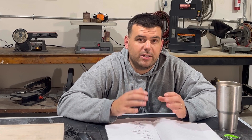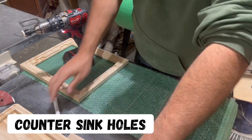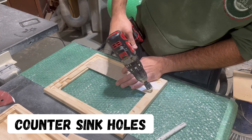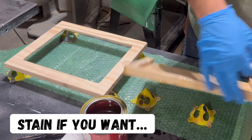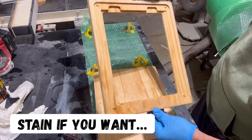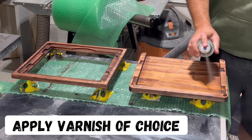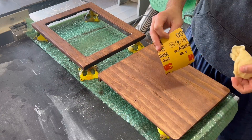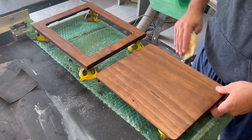I decided I wanted to stain this project, but before that I want to countersink some screw holes into some of the components. I did a dry assembly with the storage rails and the display guard and countersunk the holes once they were in place. I'm using a red mahogany stain for this project, and since it's pine, I am going to use a pre-stain conditioner before applying it. I gloved up and used a paper towel after applying the stain to make sure everything was nice and even. I let that dry for about a day, then got ready to apply my varnish, which is spray lacquer. One tip: sand lightly with 800 grit sandpaper and use a tack cloth in between coats — this will make sure everything is glassy smooth once it's finished.